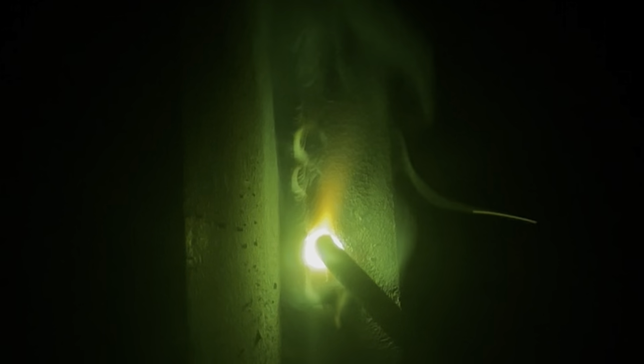Alright, here we go on our third pass. As I mentioned a minute ago, you can see how that right wall is just right there, and we don't have to do any type of oscillations or weaving or anything to get good overlap with that second bead. So that's what I was talking about a minute ago.